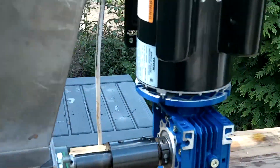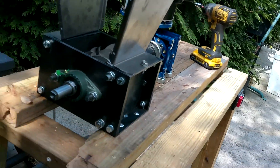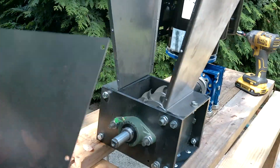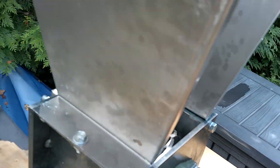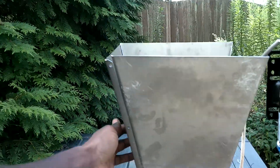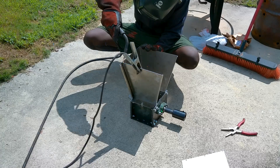So this machine from the Precious Plastics website actually came with a little bit of incomplete parts — well, not necessarily incomplete, but kind of like the wrong part at the wrong time. First of all, the shaft had no keyway on it, so I had to make that makeshift coupling there. But also the hoppers — they came with the wrong size or something, because I have two screwed in there like they're supposed to be, but this one just does not line up with the holes no matter what. And on top of that, instead of getting another correct piece, I got three pieces of the type that's supposed to be mounted to the shredder when there's only supposed to be two of those. It doesn't look bad and still works as a hopper, but I need to weld it on. So that's what we're going to do.